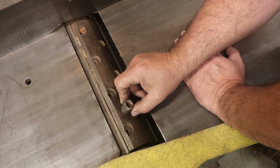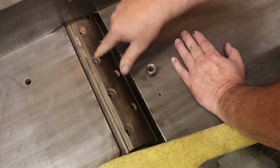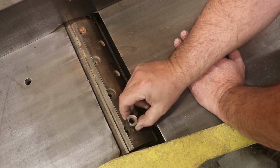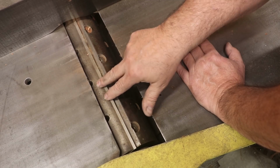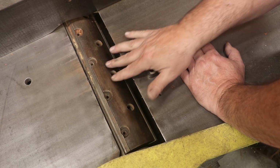at an angle. And what you do is you put a set screw inside of this piece here that's threaded, and whenever you crank down on that set screw, it pushes this up and creates a wedge, and it basically wedges this throat piece over to the knife, and that's what holds the knife in place. They're very effective. They hold it in there really well.